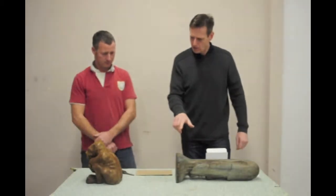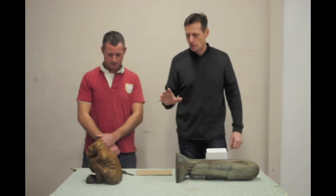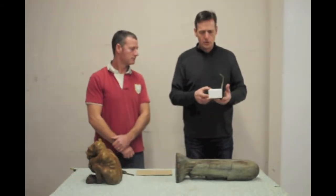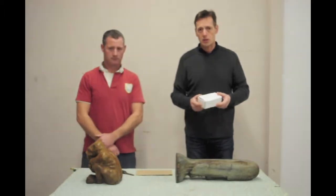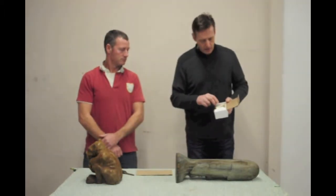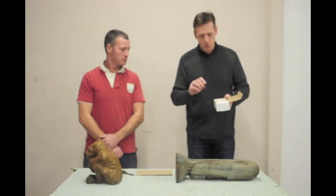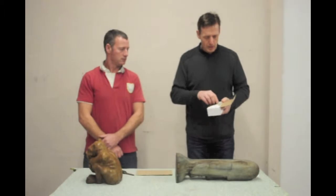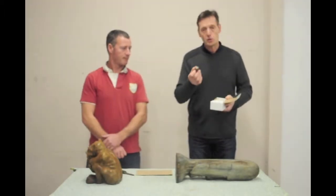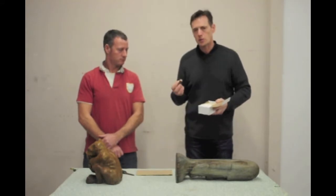So there's some voids here. We're just going to show you how to fill those, and in a subsequent video we're going to show you how to touch up the colors and match the colors pretty good. All orders to retailers come with one of these, which is a little touch-up kit. In here there's some paints for touching up the color, some sponges for application, some wobble wedges or shims which we talked about in an earlier video, and also this little guy here — epoxy putty. This is what we use for filling items. I'm just going to pass it over to Ross and he's going to talk about that.